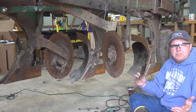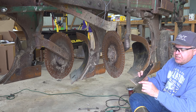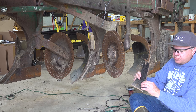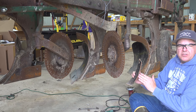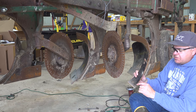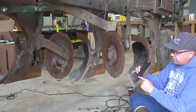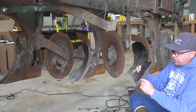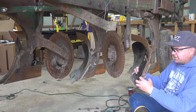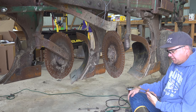There are some fascinating things about this from a steel standpoint. There are three layers to this steel. The top layer is really hard, really brittle — it will resist wear. There's a back layer that is also hard and resistant to wear. But in the middle is much more mild, softer steel that gives it more strength. So as soon as the first layer wears through, the second layer wears almost immediately because it's much softer. You'll always see it where once that first layer wears through, you're all the way to the back layer. Kind of nifty.